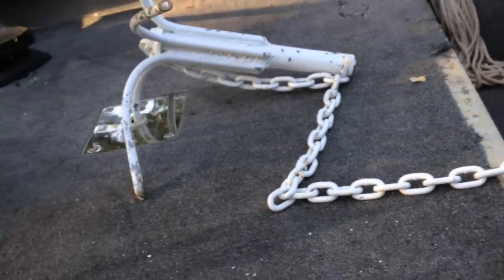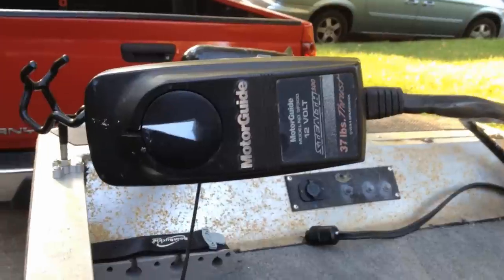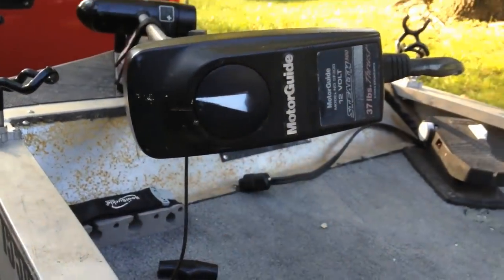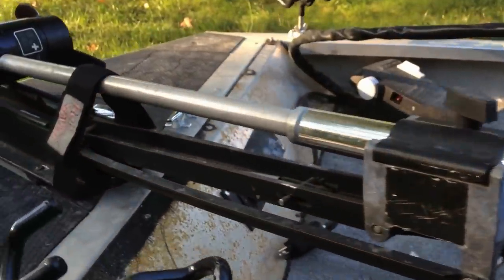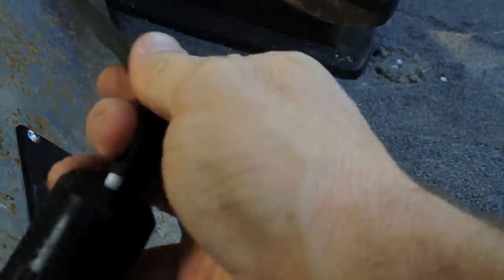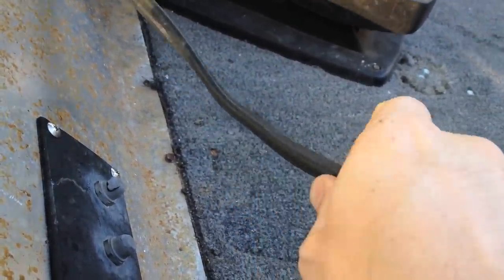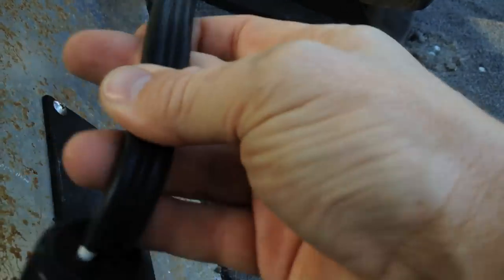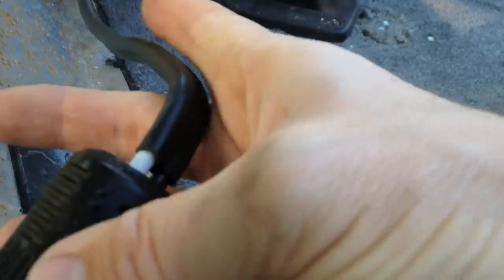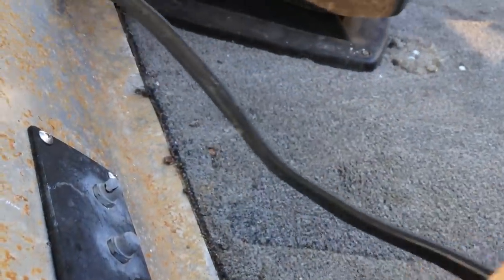It's got a 37-pound MotorGuide trolling motor. It didn't work when I got it — only had one speed and the top spun freely. I took it all apart and replaced all the wiring, now all five speeds work really great. The wire was all burned up, and getting proper-sized wire was going to be expensive, so I used braided 10-2 Romex — pulled the solid copper ground out and used the braided white and black. Bought a plug, installed it, and it works great and runs cool now.